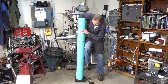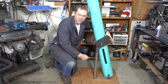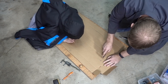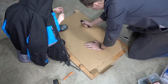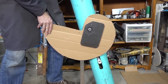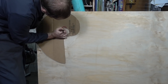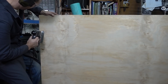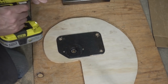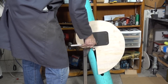Now we have to answer the question: how are these elementary school kids going to put 75 pounds of force on these springs and let it go? My plan is to make a giant wooden cam that will cock that spring and release it with every revolution. A cam is a device generally used to transmit rotary motion into linear motion. To get the shape right, we're starting with a sheet of cardboard that's easier to modify than a piece of wood. The thought is to allow kids to gradually store energy in the springs that can release all at once to launch the eggs. Once we've confirmed the fit on the cannon, we can transfer it to a piece of plywood and cut it out by hand with a jigsaw. You can see why it made sense to machine and weld a threaded stud for that bearing and CNC plasma cut the plate — otherwise this giant cam might wobble or flex under the tremendous force of the springs.